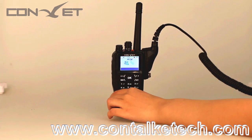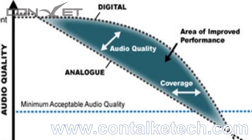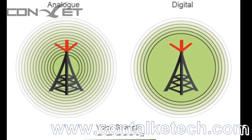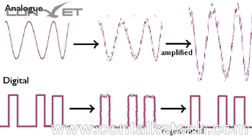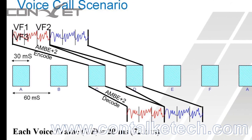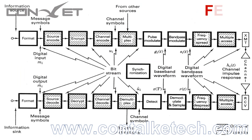The quality of both analog mode and digital mode are ideal. Since dual modes are available for user convenience, we try our best to improve voice quality. With digital mode, the DMR radio has a certain advantage in voice coding compared to analog radio. For example, if you have used analog FM repeaters, you will have noticed that audio quality degrades as a station's signal into the repeater gets weaker — noise bursts. This will not occur on the DM200 and DM300 in digital mode; their audio quality will remain the same on the uplink and downlink until the very end of the coverage range.